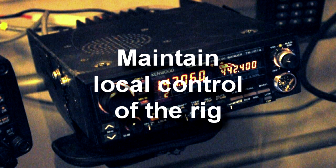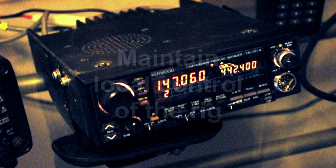Unless you make another modification and remove another surface mount resistor, this radio does have a three-minute transmit timeout built into it. So unless you've made that modification, if the rig gets stuck in transmit for more than three minutes it will switch back to receive automatically.